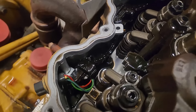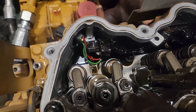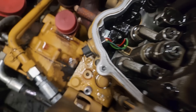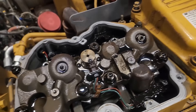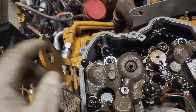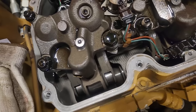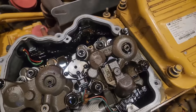Most of the haul trucks I've seen the overheads on do have rust on them for some reason. Not a lot on this one, though. Look at that connector - it's actually the coolant temp sensor. Instead of like on the trucks where they run it outside, on these haul truck engines they run the wiring for the sensor through the valve cover base, and then it comes back out and goes to the thermostat housing. Pretty interesting. This one does not have IVAs, by the way - just jakes.